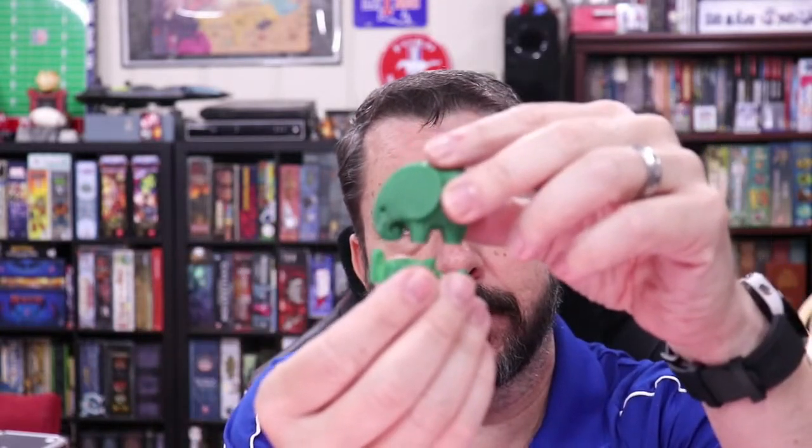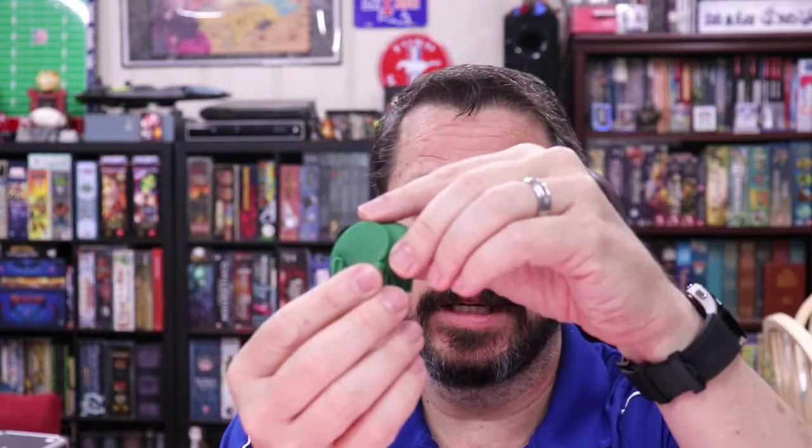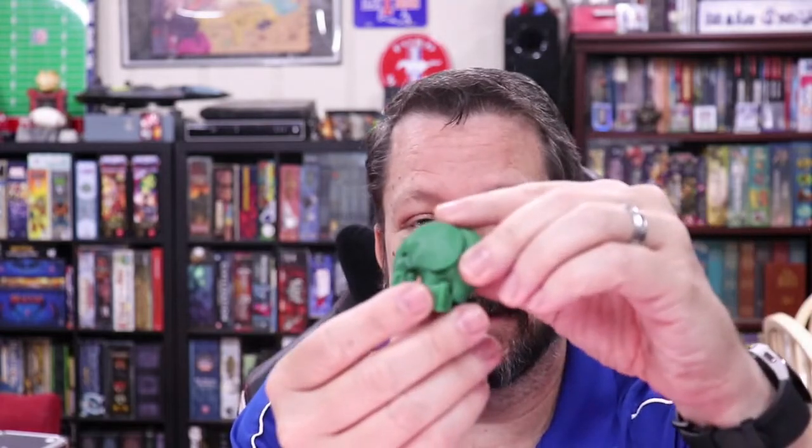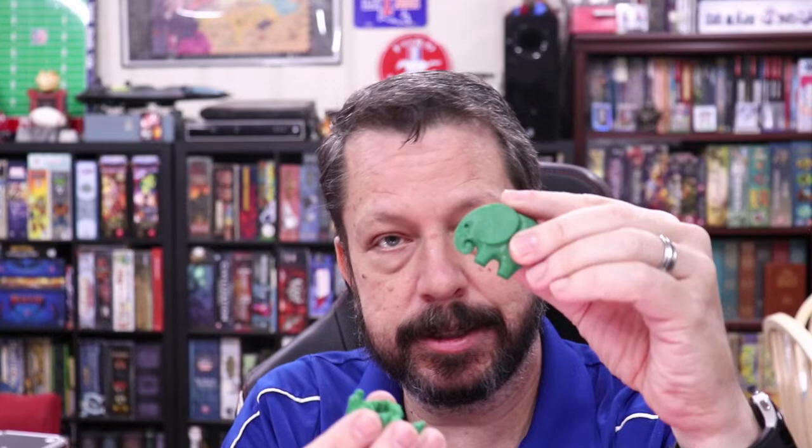But this is just an algorithm that designs a little support structure for your part that you're trying to keep. And then later when you're done, assuming you've got your settings right, there are some settings in your slicer that can affect how well this support is attached or not attached. Obviously, too loose and it's not really doing anything, and your part sags anyway. Too tight and it becomes part of your part and you can't get it off of there. So there are some optimizations.